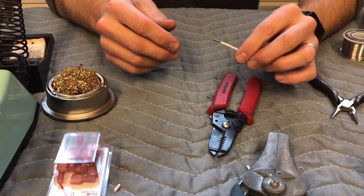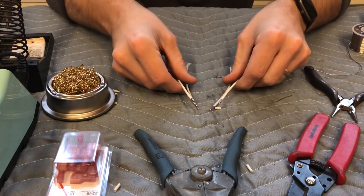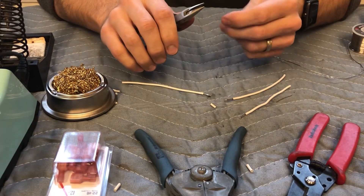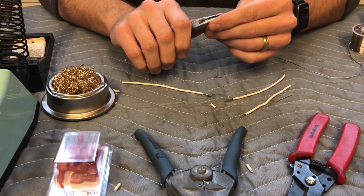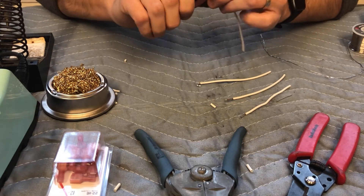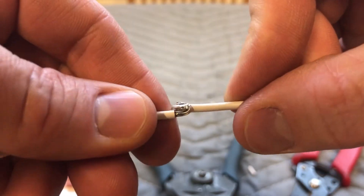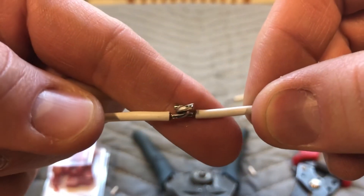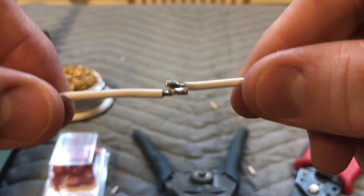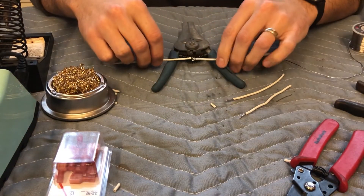So I'm going to cut another piece and show different configurations of soldering. I have four wires here — I'm going to solder two into one, basically doing a butt splice. There are two different types. If it's going to get tension or be pulled on, one trick is to put a little hook on two of the ends using small needle nose pliers. You clip them together, pull them together, and then pinch them down with pliers so they don't move. That's the hook style.